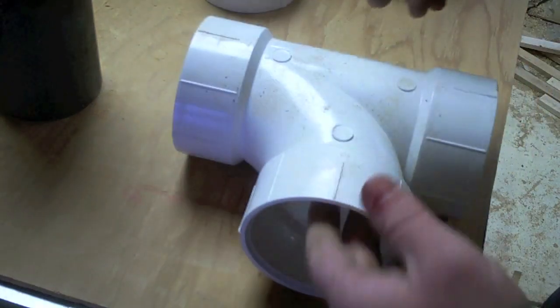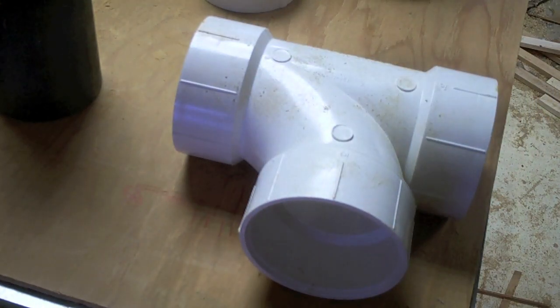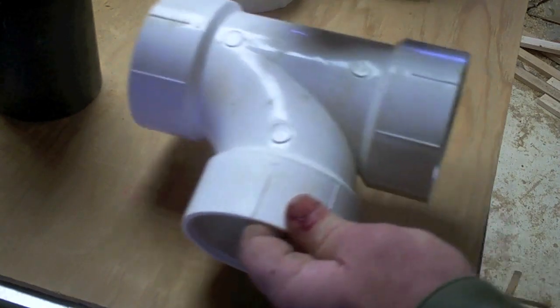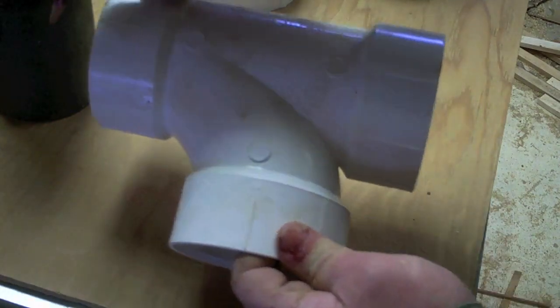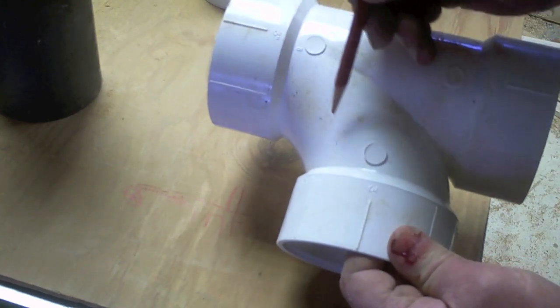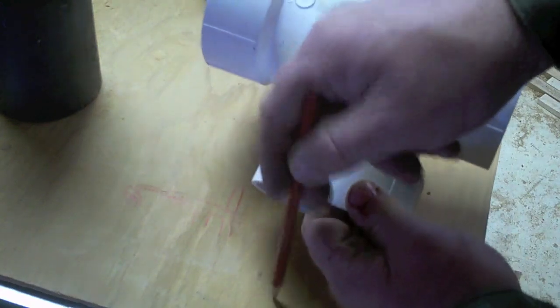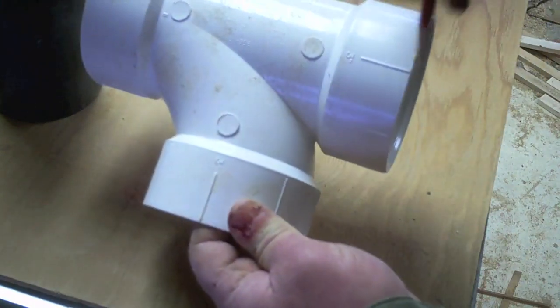But I'm not worried about it. We're moving a three-inch column of water with a three-quarter inch draw line and a one-inch carry line. It's going to be fine. That stuff is going to drop down on the bottoms of the pipe, and then as it goes over the top of this, it'll fall down inside this pocket right here and come out of the water stream.